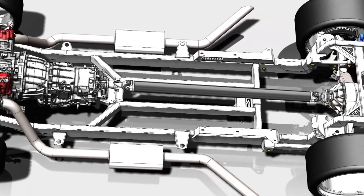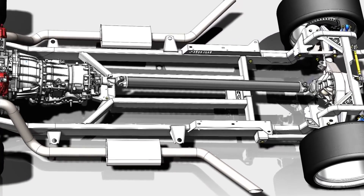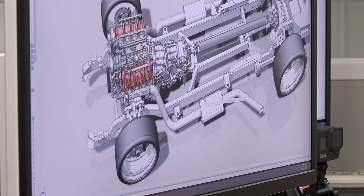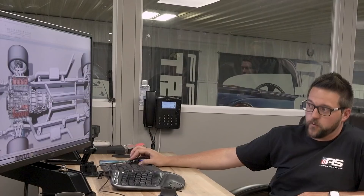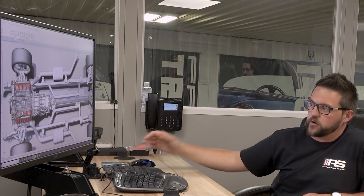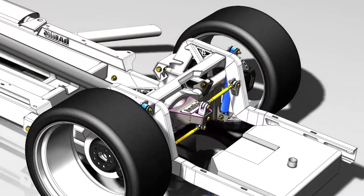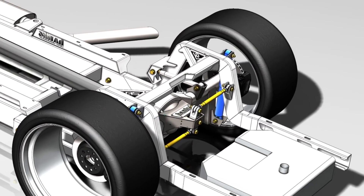On this chassis, if we're hitting over 600 horsepower, where have you strengthened it? Usually on our spec platform, they're kind of bare bones in the center section. The wheelbases of most short-bed trucks we deal with do not need a lot of center structure support or triangulation. For this, with the torque rating that everything has on this truck, we actually did put a second series of center structure on the inside, bulk-headed by that transmission mount, and gusseted and torque-boxed all those sections as much as we possibly could — including up on the rear truss area where all the actual power is going to put to the ground.